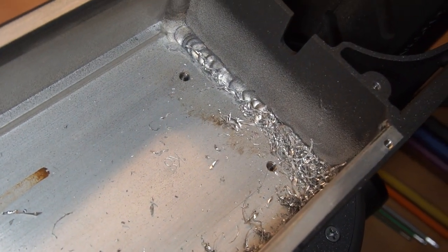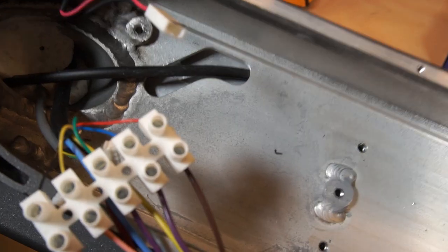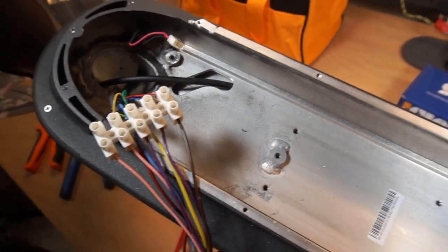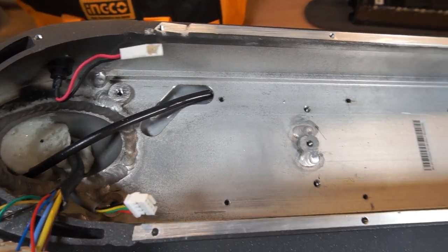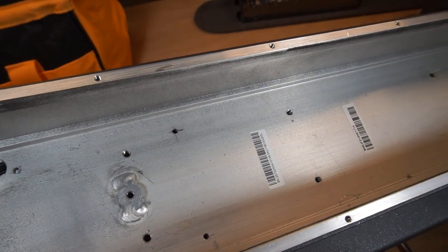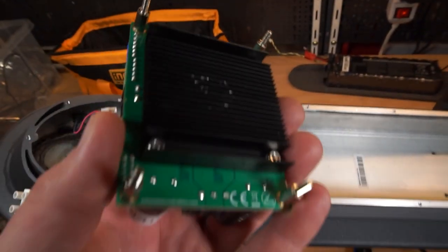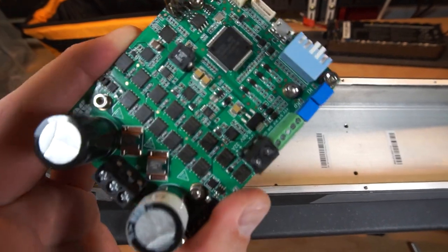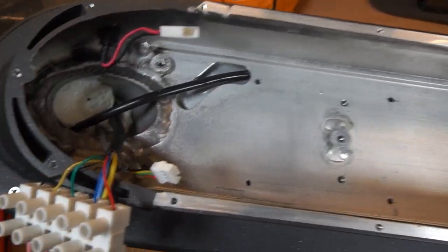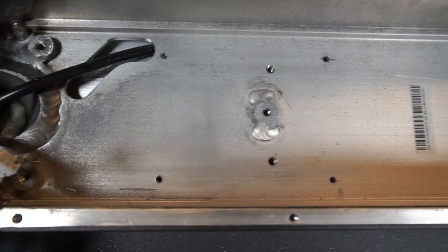So we need to clean this surface here to prepare the place for the battery, and we need to put a controller here. I cleaned all this surface with special tissue and the brush of chips, because otherwise, if we have some small metal dust, we probably can short-circuit the board, so it is better to avoid this. The holes are done. Don't ask me how it was.